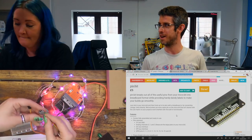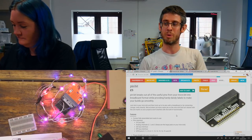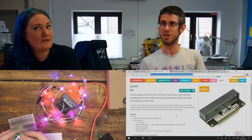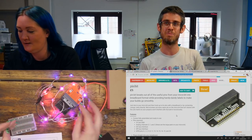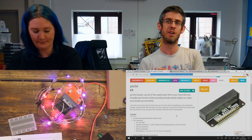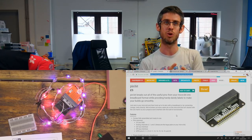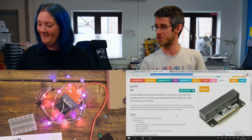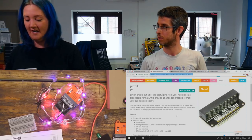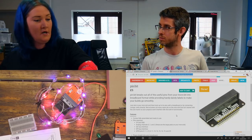Funny you mention that, because I know that John and Nico, when they've been making these micro bit add-ons, have been struggling against a number of barriers, one of which is the current limitation for add-ons, another of which is the limited amount of memory, which Phil's really been struggling with. Yes, the limited amount of memory is why they say you should only run 8 neopixels off one of them.